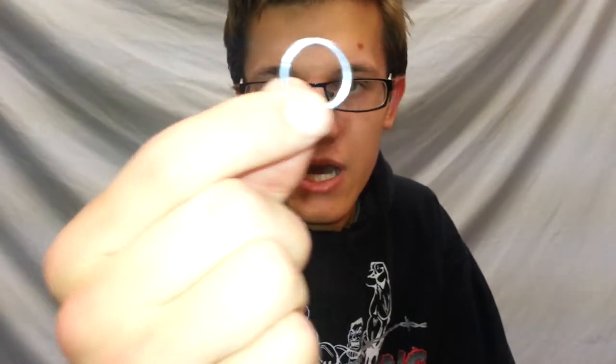Okay, recap of what we did today: we went over what kind of rods to use, how to make the coils, and then how to make your rings. These are 5/16ths. We went over my new project using 5/16ths rings. This will tie together across with triangles — it should work. When I hold it up, you can see through it, and you can see it falling together and condensing more at the bottom than at the top. You want it to lay all tight and nice. This is addicting to play with in your hands, by the way.